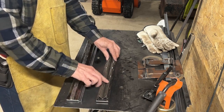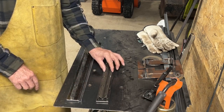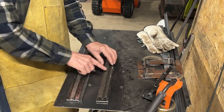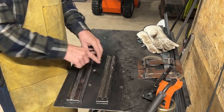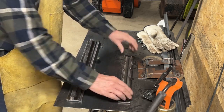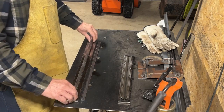The other problem I had was when I made some things with very small flanges, I had to make them with a larger flange. It had to be at least 5/8 of an inch. I basically went for 3/4 of an inch because I didn't want the edge of the flange coming below this surface until it was all the way down. Otherwise, it was too hard to keep it in position. So what I'm planning to do is change some of those features, make it a little stronger.